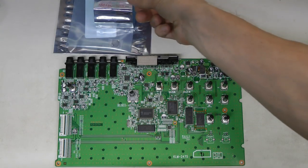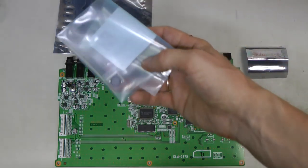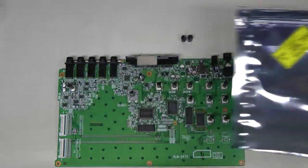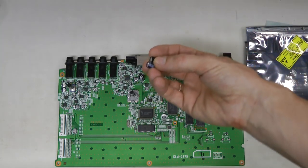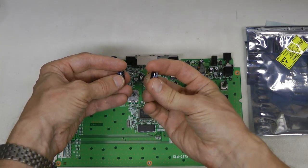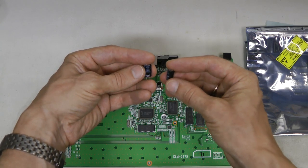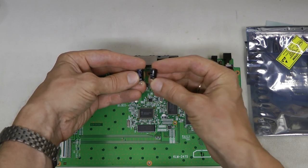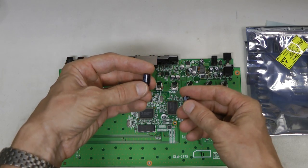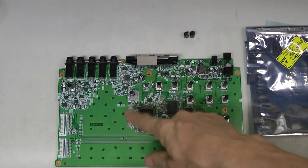All replacement parts have arrived. These are 5 MOSFETs from eBay, an inductor from DigiKey, and a couple of step-down converters also from DigiKey. I did not order capacitors because I have plenty of them. I have a 16V capacitor with exactly the same dimensions as the original one, and a 25V capacitor which is slightly taller but not taller than some other parts on the board, so I am inclined to use the 25V capacitor. Let's try rebuilding this step-down converter and hope that the rest is alive.